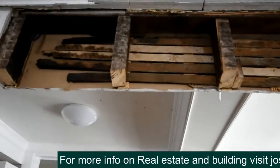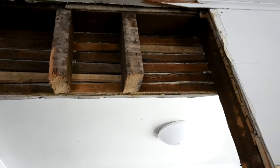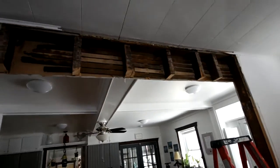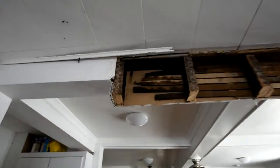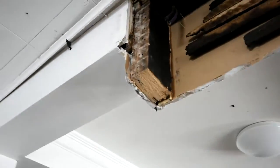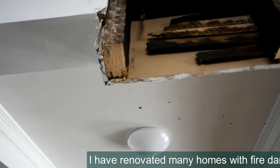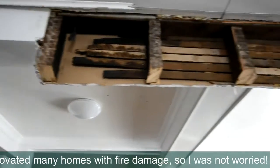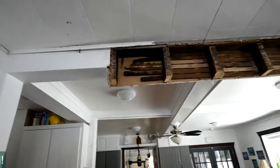There's lath in there, but there's no plaster back in there. But over here, there is a bit of plaster. So I give her a real good vacuuming in that. Like I said, we did have it tested, and they said we're good to go. Looks like there's remnants of an old fire up in there, but we cut the studs off, so they're perfectly fine. They're just scorched, but they're perfectly fine. And it's a non-supporting wall, and so we're good to go there.